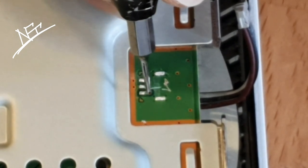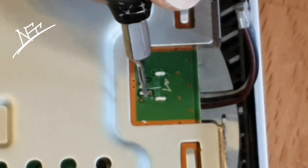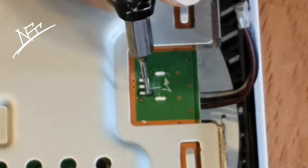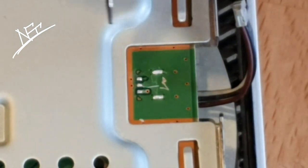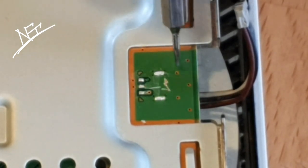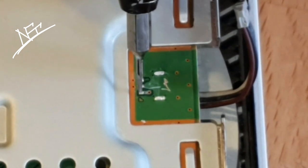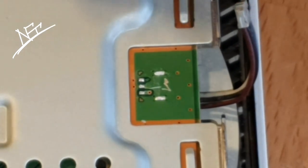This is the most important, guys, that you should know, because this here is the 12 volts line. This contact you don't solder with ground, because you can see here all around is just ground — this is just minus. But this one here inside is the 12 volts line. In the middle you got just the ground. All the PCB around here is minus and ground. That's why you need to take care that you do not solder over this line here. You need to stay here inside, otherwise you're gonna short it, and then it's game over.